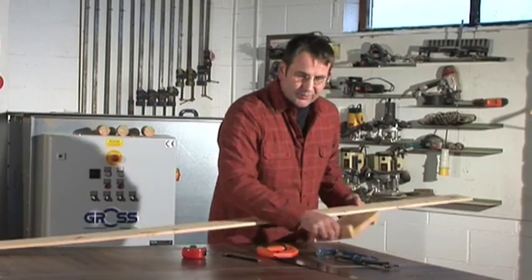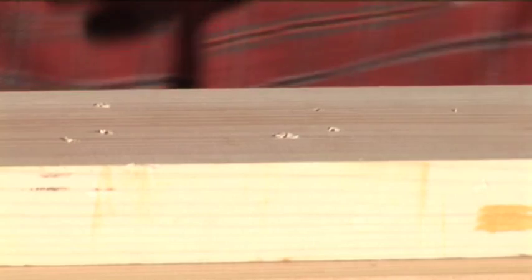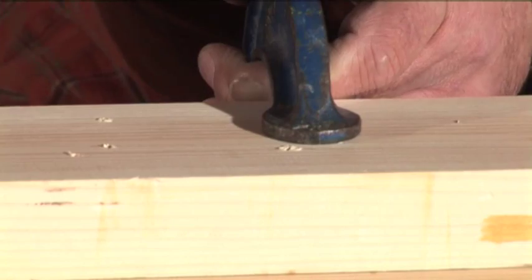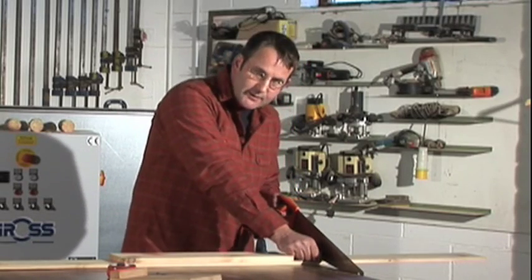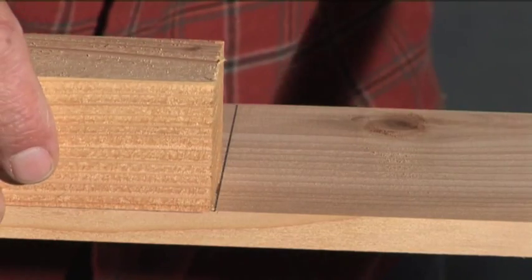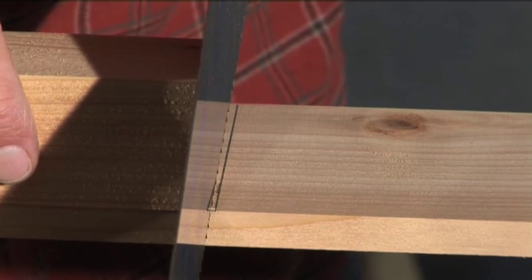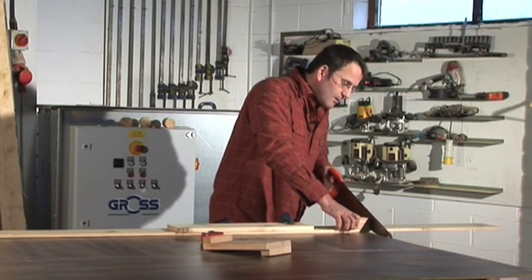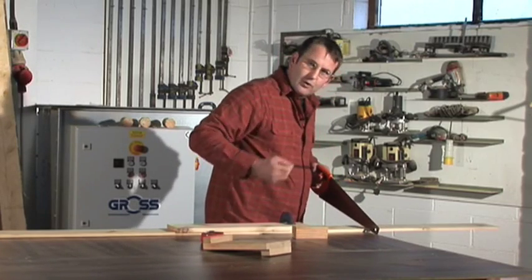If you don't have a bench hook, then what you use is a G-cramp. G-cramps are great. Take another piece of timber, stick it on and use that as a spare piece to cramp. Starting off, a lot of people tend to start like this, but I try and keep my thumb away. So a good idea is to use a small piece of wood against the side, hands up out of the way, and then you can start from there. Get the thing going nice and gently - it's the saw that's going to do the cutting, not you forcing it.